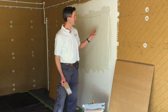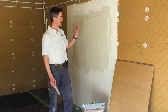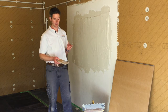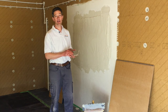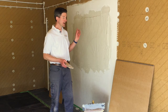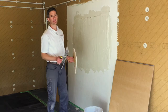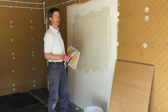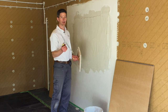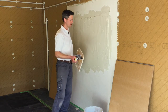What I've done is used the UDI foundation coat as a plaster on the wall — we've put that on already. The UDI foundation coat is used specifically because it's very fine, so it goes into the honeycomb layer really easily and gives you a really good strong bond, which is quite important when you're sticking that to the wall. What you have to do is go over it with a notch trowel, which essentially makes sure you've got the right thickness of plaster on the wall before you put the board on.